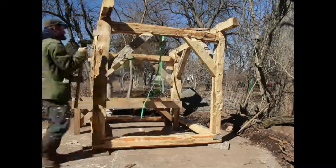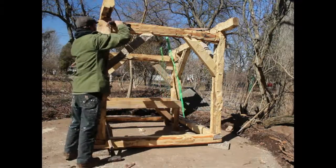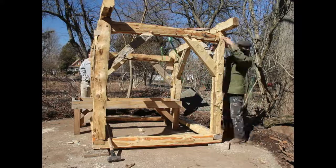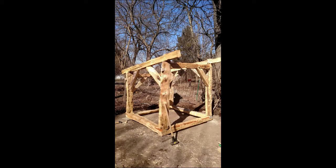Now I'm drilling to add a few more bores through which we're going to drive some pins, and that will help keep everything together and nice and tight. And this is the finished frame. We haven't added the door or the rafters or anything, but that comes in the next video.